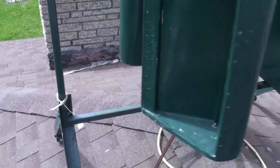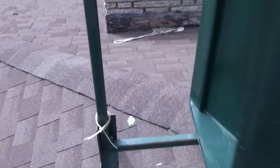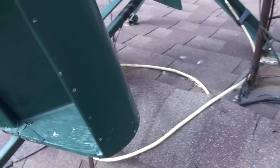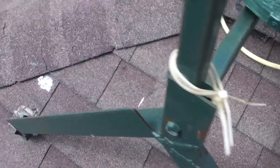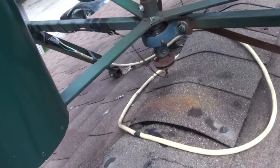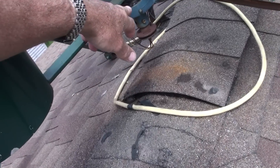One picture is worth a thousand words. For the frame, this is one inch diameter steel tubing, fairly light wall, not real heavy. This is how the pillow block is mounted in the center on your bottom support piece. The bearings are one inch down here.